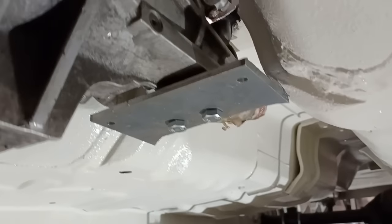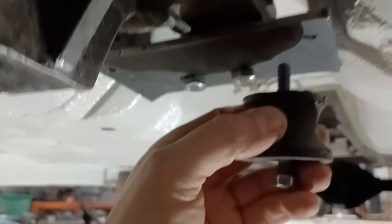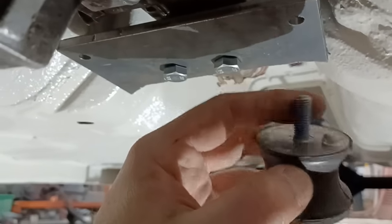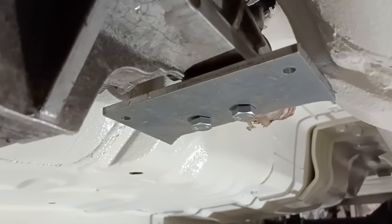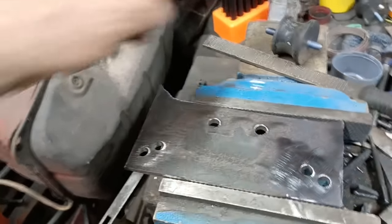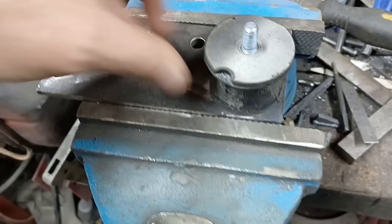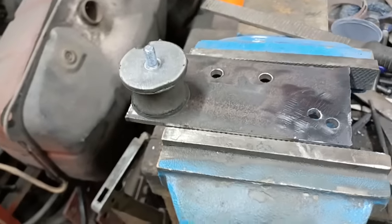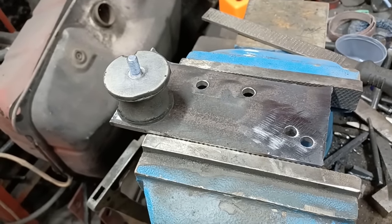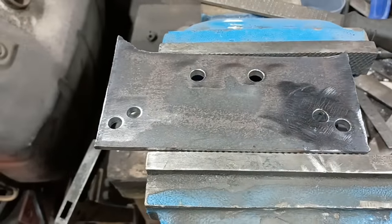As I was walking back to the bench I had a brainwave. These bobbins have got a little locating nib on them. I could bring these in a little bit — drill a new hole the same distance away — so that will be my locator. Same on that side, and these will just be in a little bit. That means I don't waste that bit of steel and the work already done. The lesson of trial and error has worked. I drilled the hole directly across, then of course it was overhanging, so welded that up, drilled it at an angle, and now we can fully support our bush on both sides with a nice little locator.